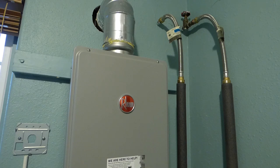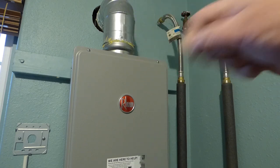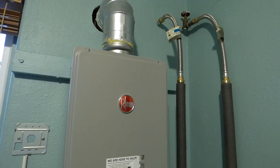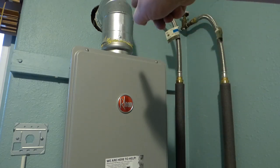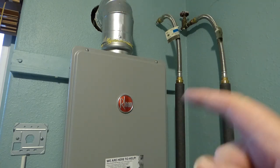On the outside, on the other side of this hose, there's the metal plate. I'm going to take a razor blade and scrape off any kind of old gunk around there, and caulk on new fire block — fireproof, goes up to 1,300 degrees. I'll put two more of those screws in here to hold up this arrangement, and then we'll be back to connecting things.